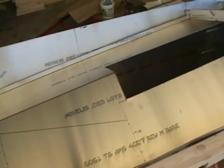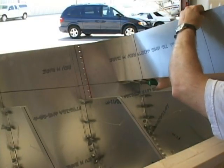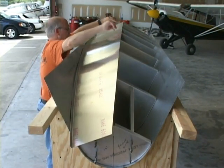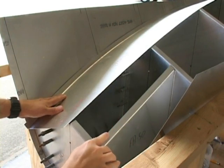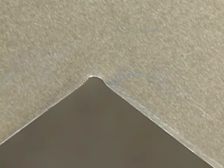And here's what the skin should look like. Notice our rough cut opening. Now we're going to trace along the edge of the front nose wheel well, because we don't want a sharp point when we have an inside corner like that — we want it rounded.